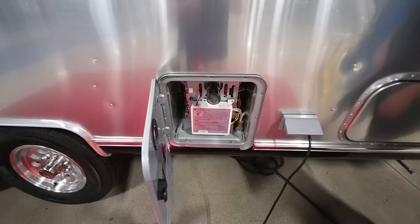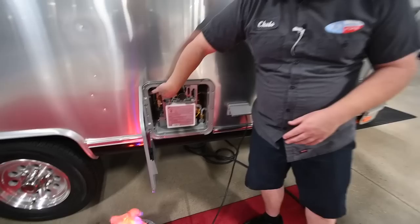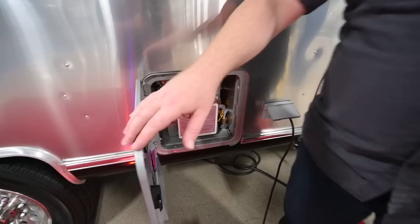Next to that is the water heater. This is an on-demand water heater — it is not technically tankless but will behave like one. There is a little 0.4-gallon tank. There's no drain plug and no anode rod, so for most folks it's basically maintenance-free. The control panel you'll interface with is in the bathroom. The default for that control panel is on, so if the trailer is powered, the panel is also powered — but being on-demand, you have to draw water through it to get it to do anything. Outside here we'll find a master disconnect switch that will disable the entire unit, and a pressure relief valve. The water heater is propane-fired, so in addition to having a propane bottle open, remember there'll be a hot propane exhaust coming out — make sure you haven't blocked it with anything flammable.